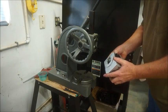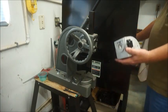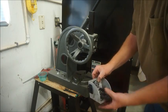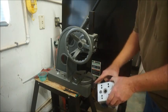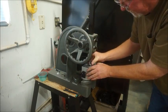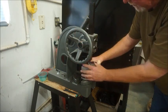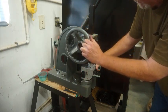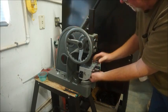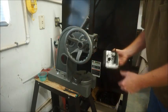Here we have the lower part with the hook in it. We've got this apart, so I want to replace the bearing in this while it's apart. I'll set it up on the press here and line this up to get it ready to press out — this is just an arbor press. This one's going to come right out. It took no effort at all — nice snug fit, but it really came out easy.